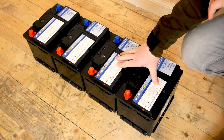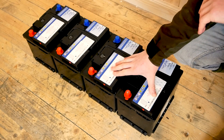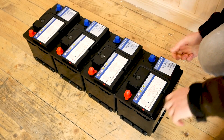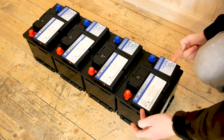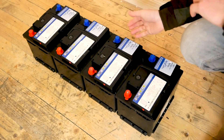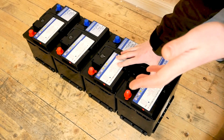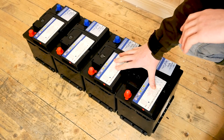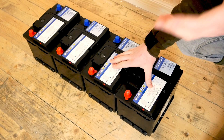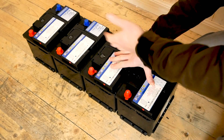Let's have a look at these batteries. These are 60 amp hour lead acid FLA batteries and they're deep cycle, so they're made for long-duration use like running household appliances. These FLA batteries differ from AGM batteries in the fact that these need to be vented. When you take these transport caps out, the batteries are going to vent - I believe it's hydrogen gas as well as another type of gas, which can be bad. We had two of these batteries sitting inside, which was kind of okay with a window open, but once we're adding more batteries, it's much better to put them outside since there's going to be more gas coming off these things.